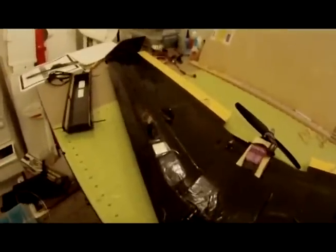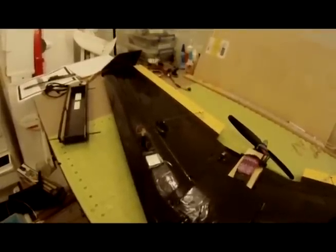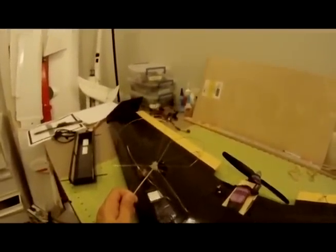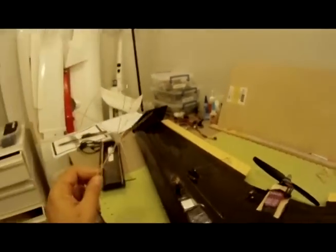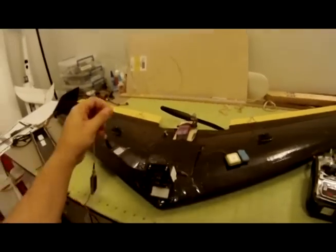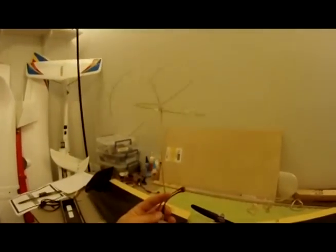So now this video system is a 5.8 gigahertz 200 milliwatt system. I've also got a 900 megahertz 800 milliwatt system, which is right here, and I've made a set of cloverleaf and skew planar wheel circular polarized antennas for this, and you can really tell the size difference there between the two. I don't know if this is going to be good for this machine. I could actually probably put this antenna somewhere like this, and it would probably work fine. But I'm really looking forward to this 900 megahertz 800 milliwatt using the circular polarized antennas.